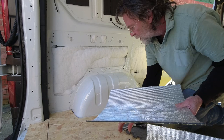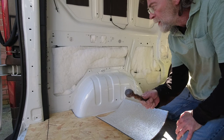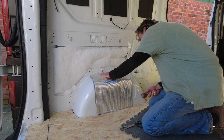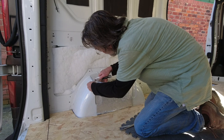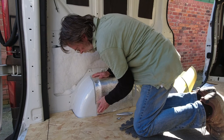We've got these voids to take into account - same thing as the floor. I'm going to use a screwdriver to push this stuff into these voids and we'll see how that all goes. The corners are not going to go in very well, so I'll push them in and cut a little V-shape out to make it fit. Then push this down - this is all going to get taped up afterwards so any little discrepancies we'll sort out then.